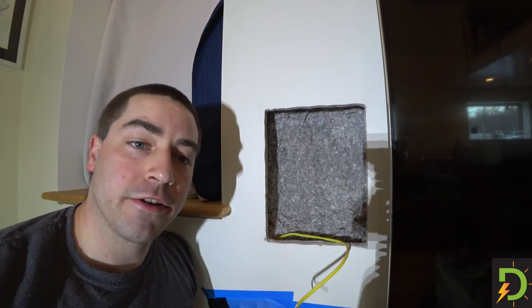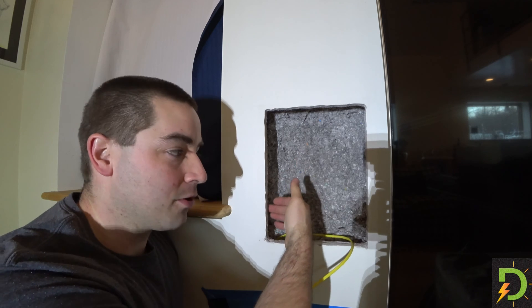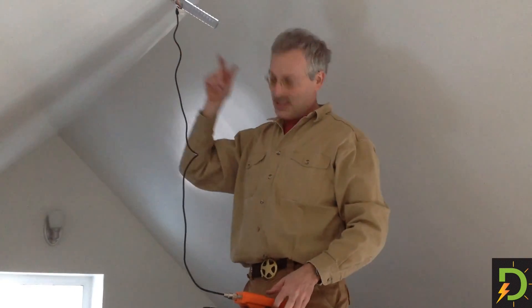My air barrier is on the exterior. I have no air barrier on the interior — no Intello Plus or any membrane. Cellulose actually has hygroscopic properties, which means that the moisture is constantly trying to equalize inside the cellulose itself. So I don't have moisture problems in these walls. My friend Bill Hallstrunk, who's been studying this stuff for decades, has come out in past years and probed these walls — no moisture problems.